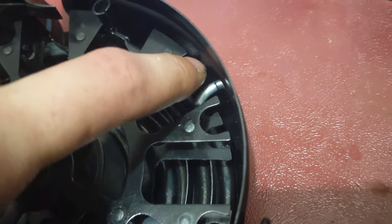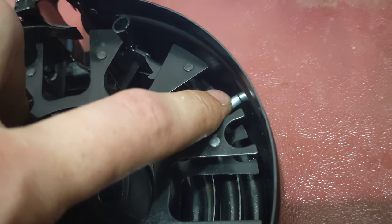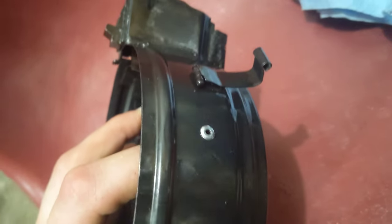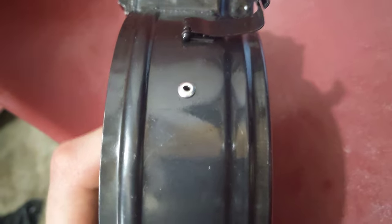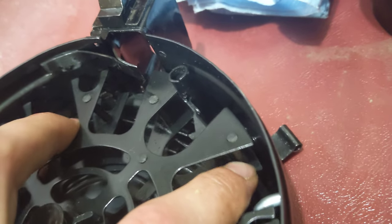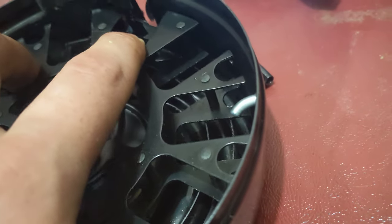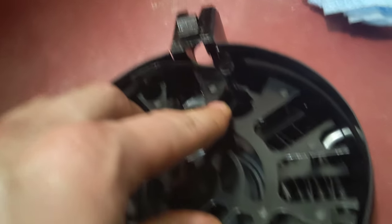So you just want to get an eighth-inch by half-inch long rivet. Basically just want to drill on the side - I'll give you guys the measurements in one second. Just halfway in line with that pivot point up there. It doesn't have to be perfect; you have a lot of wiggle room. As long as you're touching this pivot point it doesn't really matter, and as long as it's not touching anything else. Drill your eighth-inch hole, put your rivet in there, get it clamped down.